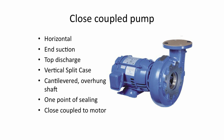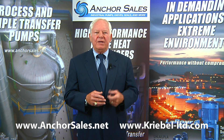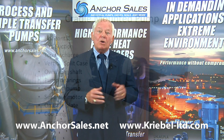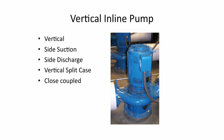Pumps under 25 horsepower are sometimes supplied close coupled, where the motor shaft extends into the pump and functions as the pump shaft. These are compact and simple pumps. Or they may be cradle-mounted with separate drive motors connected by a coupling. Sometimes small pumps are vertical inline designs, which are compact and take up less space.